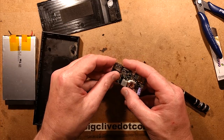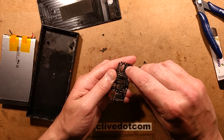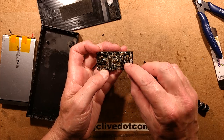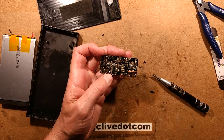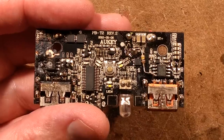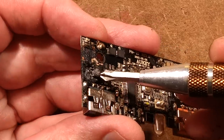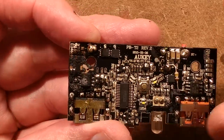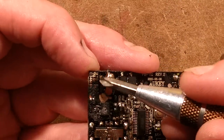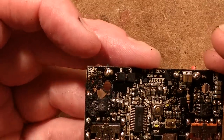I'm guessing the little chip at the other side - let's see what the number is - but the number is basically a big skid mark, it's all really burnt. I guess that is a little boost converter. There's one on this side as well, with a little resistor patched across there too. Let's get in close for a better look. There is the Armageddon that has occurred here - it's really black and crispy, really burnt into the circuit board. I wonder if that's just smoke residue or if the tracks have been passing a lot of current - I think they probably have been.